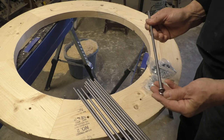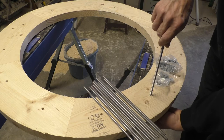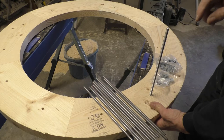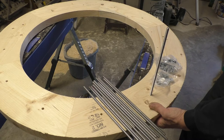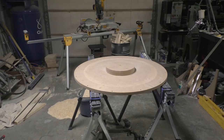and these will fit through the ring. This will be the bottom ring, and then we can screw the nut on the bottom, and then we'll just put one of these in each hole. And then as we glue up the rings on here, we'll get the offset done the way we want it. We can put nuts on here and screw it down and clamp it. We got other clamps, so just as we go build up, we can just start clamping everything together, wait for that layer of glue to set up sufficiently, and then we'll go back and put the next layer on it.